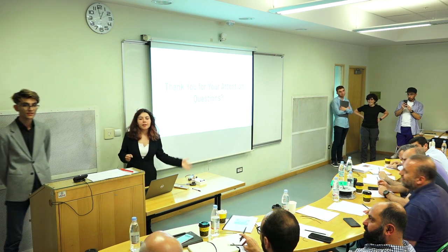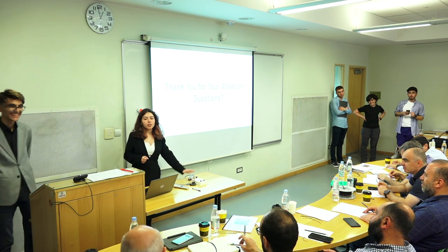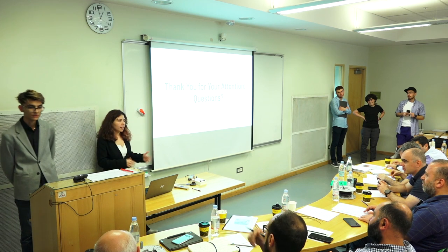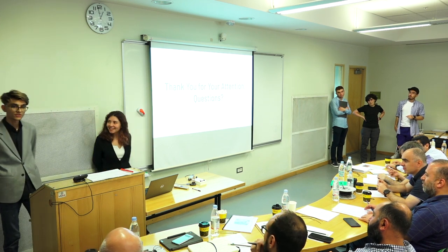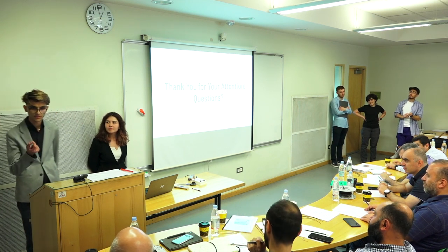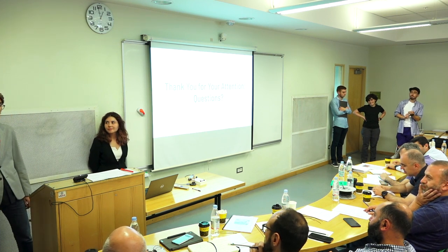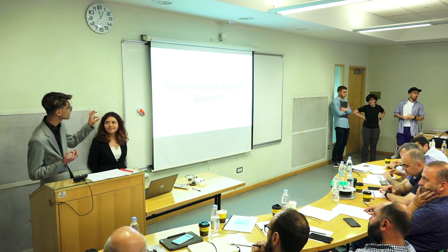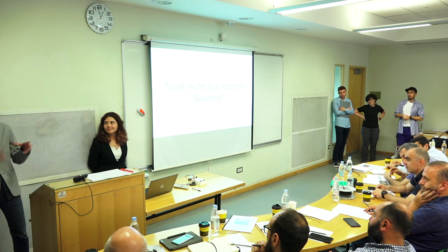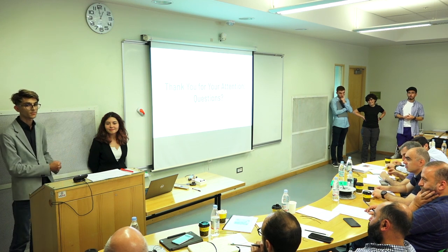Yes, and also it had to have a constant power supply, which in this case we do have, but this can be replaced with a battery, which is not the case for their design. So there were pluses and minuses. Another tablet design uses piezoelectric actuators instead of electromagnets. But each one of those pins costs $1. In our case, we could have done a whole character with $2.6. Imagine, again, six pins would result in $6, and that's almost doubling the price. We're cutting the price by a lot.